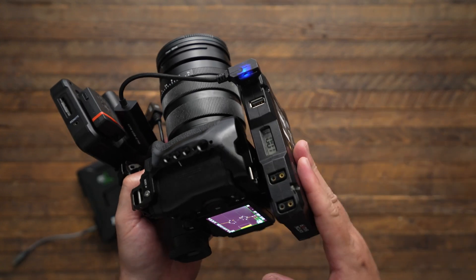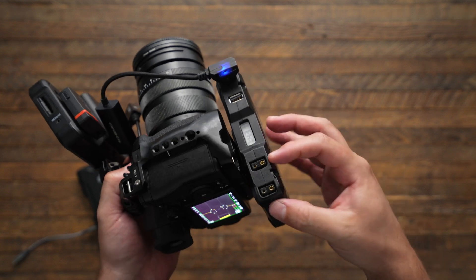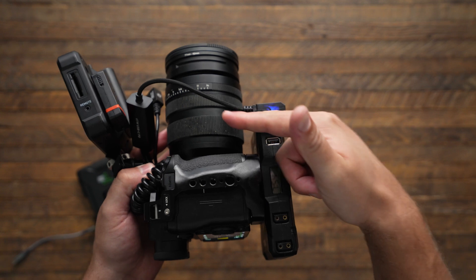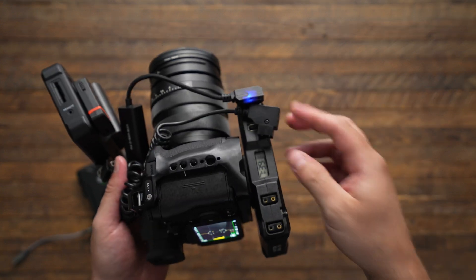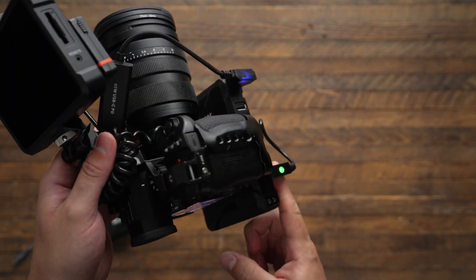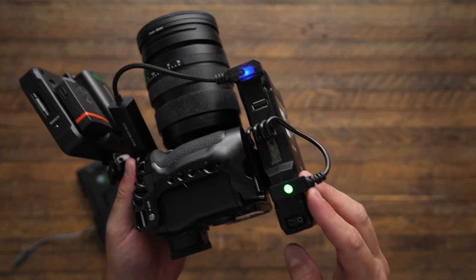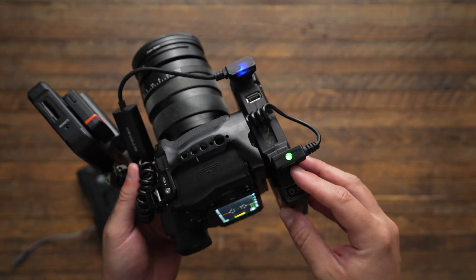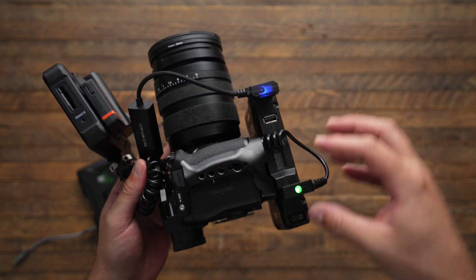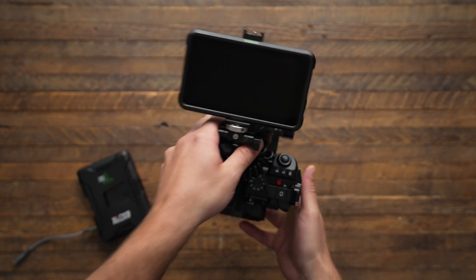One thing that is annoying about this setup: previously with USB it went straight off the side, but you can see these D-Tap ports have a certain orientation. So this one, when I plug in, the cable goes up — but any other D-Tap cables, because of the way these ports are built, end up having to go down, meaning underneath the camera. If you try and set this down, you end up setting it on the cord, and that's really irritating. So I'm actually working on a solution to reroute the configuration of these ports to make sure all the wires are going up towards the camera, away from the base, so I can actually set the thing down.